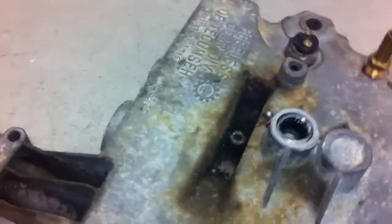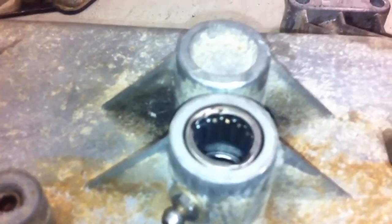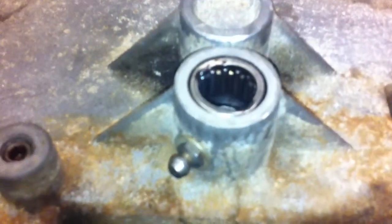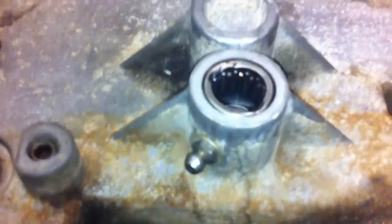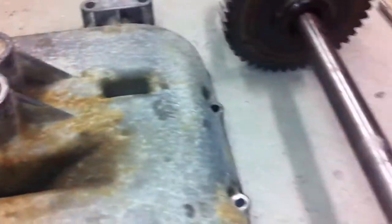The big thing I've done — we added a grease fitting. I pressed the bearings out; it's funny, one bearing was all beat up with a couple of nicks in it, but that must have been like that from the factory. I pressed out those bearings, drilled for the grease fitting, and pressed my bearings back in.